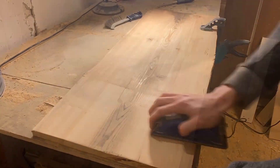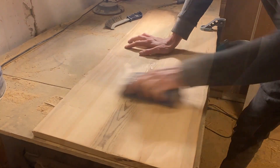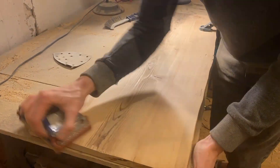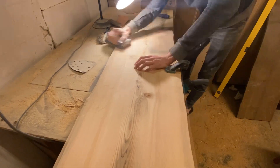This is the first round of sanding — I'm only going down to about 100 or 120 grit, and in the final finishing process I'll sand up to 1200 grit. The routing went pretty smoothly, but next to my clamp there is one small piece of tear-out that will need to be fixed later with some epoxy and sawdust.